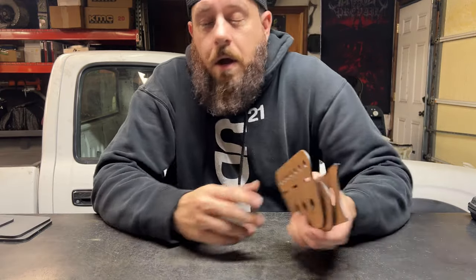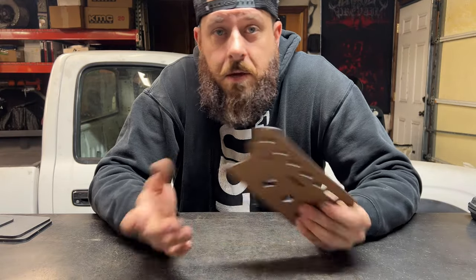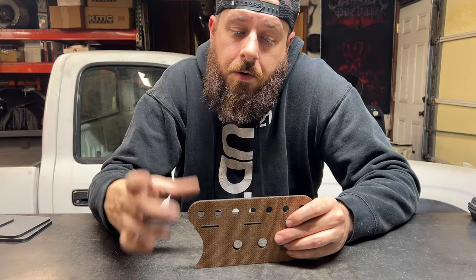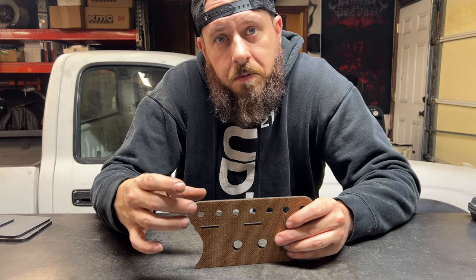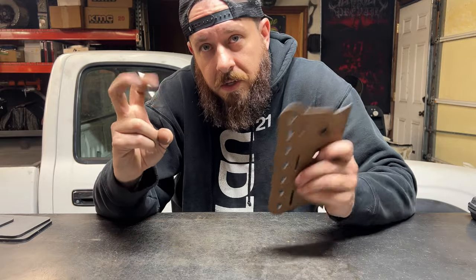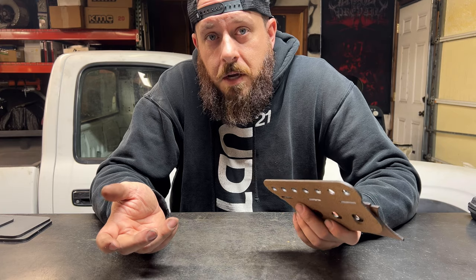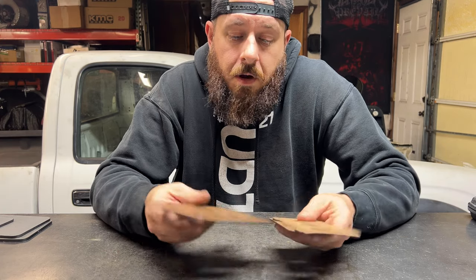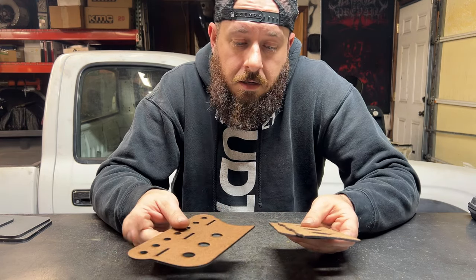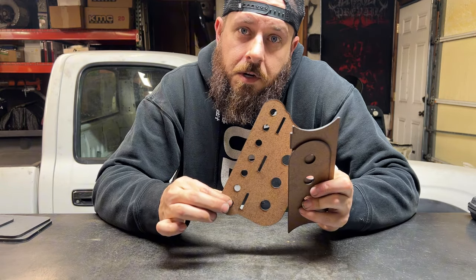Also, my stock axle has 4-link bracketry that I made by hand, and then bought a coilover bracket, like an adjustable perch, and welded to the back of it. I wanted to keep everything the same geometry on the new axle so I can just bolt it in, with minimal changes and adjustments. So I redrew the same bracketry in Fusion and added the coilover perch on it